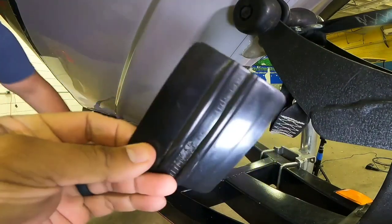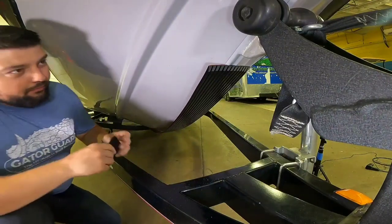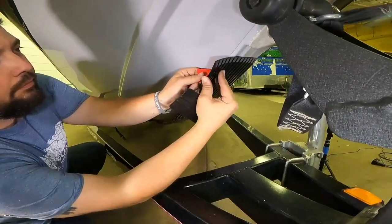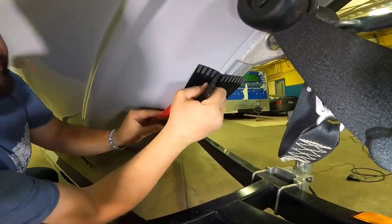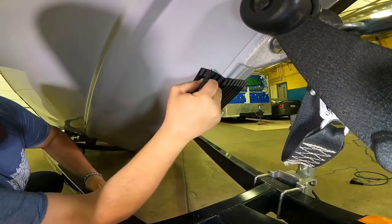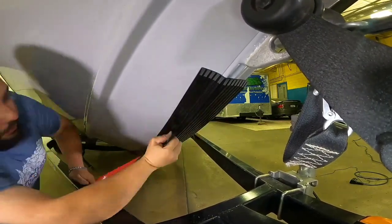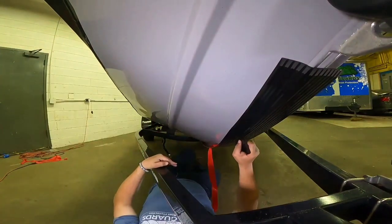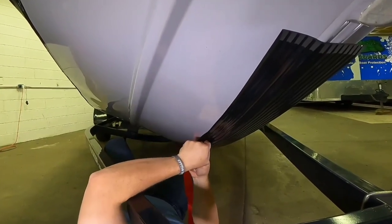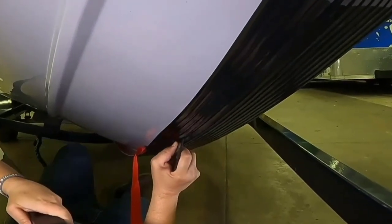Once it is lined up, this is where the squeegee comes in. We use the squeegee and run it across the ribs within the keel shield itself to stick the 3M adhesive directly to the hull. We do this by creasing the middle first, and then once the middle is nice and creased, we very carefully curve it around the keel itself. Once it's around there and we've got a nice firm press and know that it's applied correctly, we go down each of those ribs working one side at a time, one line at a time, from in to out. As long as you do this step from in to out, you should have no distortions, bubbles, or irregularities in the product adhesion.